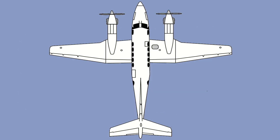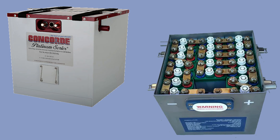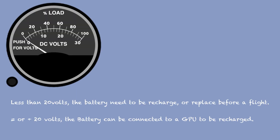The battery is located in the right-hand wing between the fuselage and the engine nacelle. Two types of battery equip the King Air: the traditional lead-acid battery was installed after BB-1631, providing 24 volts and 42 amp-hours; and a nickel-cadmium battery which equips the King Air 200 and B200 before BB-1632, providing 24 volts at 34 amp-hours.